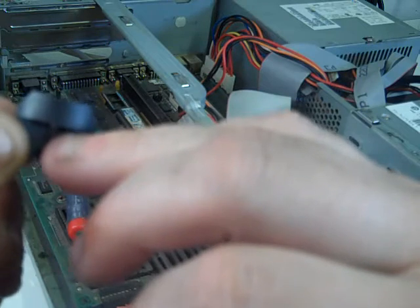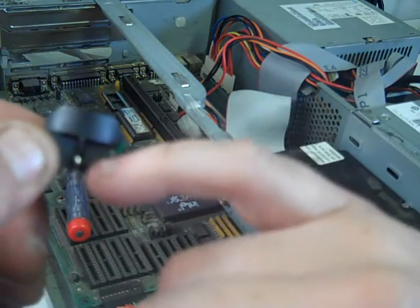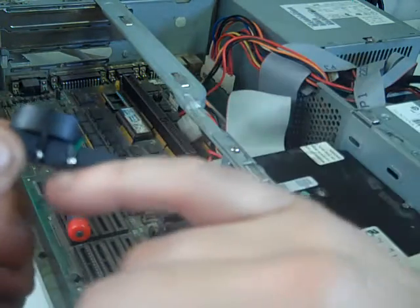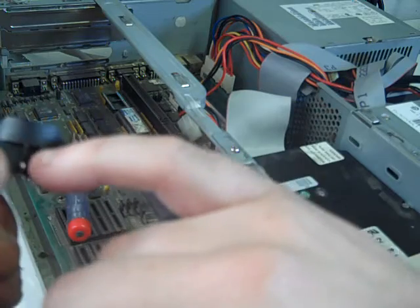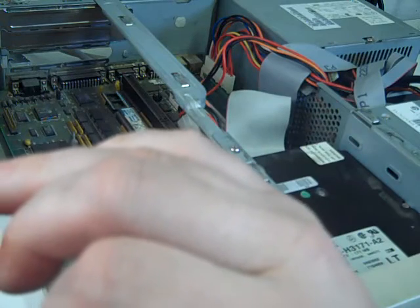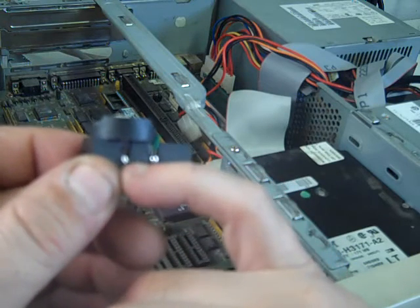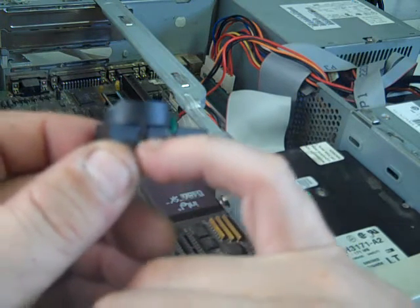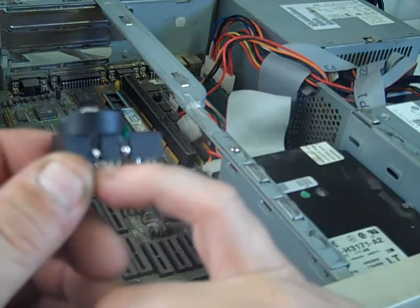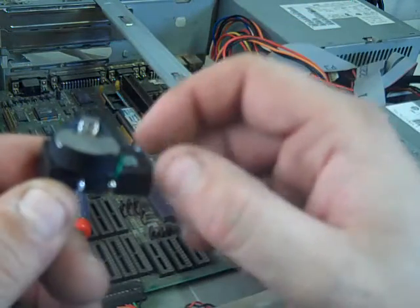And you have to break that connection in there with a little drill bit or something, so that that leg no longer connects the internal battery. And then what's left of the leg you need to solder a wire to, and then connect it to the positive. Is it the positive? Sorry, the negative. This is the negative. You have to connect it to the negative of the battery holder, and then run a little wire around from that side. You don't need to bother disconnecting the battery from this side because it only needs one side disconnecting. I'm not on the shot there. So you only need one side of this battery disconnecting. So you break the negative side up there, connect the battery up, solder to the remaining bit of the pin down there, bring the positive wire round and solder it on there. So this battery now replaces the internal battery.